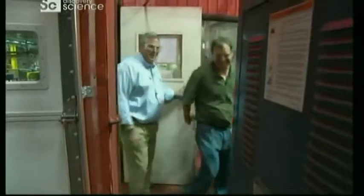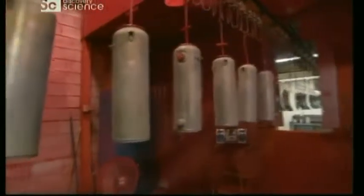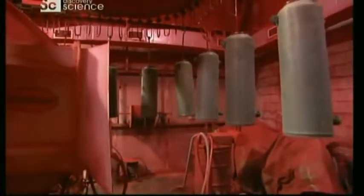Ah, it's the paint shop, you bet. This is where we add the signature color red, the fire engine red. And as you can see, we have the 20-pound shells going down the conveyor line to be painted through the automatic paint line. So this isn't paint like we think about liquid, runny paint. This is like little particles that are dry. Exactly. This is a durable polyester-based paint.